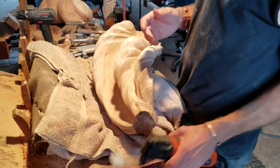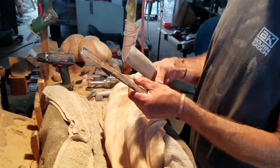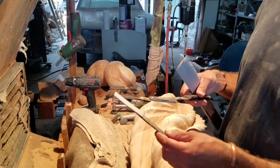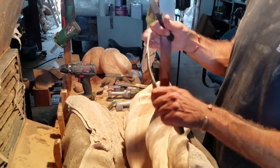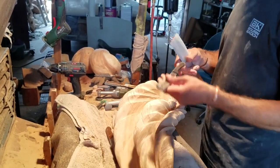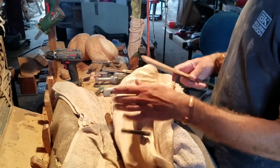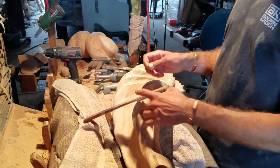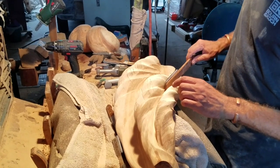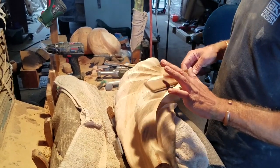Past 150 grit I'm making my own form tools. These are old butter knives — or that's probably a bread knife. I cut and grind the edge off and it has really good flexure; it's spring steel so it helps me get around curves. This is just an old cheap steak knife — go to Salvation Army or Goodwill and get several of them. Then this is an old wood wedge, I think that's redwood — very soft, very light. I actually don't want a hard wood on this because once in a while upon sanding the wood will bump the workpiece and leave a dent.